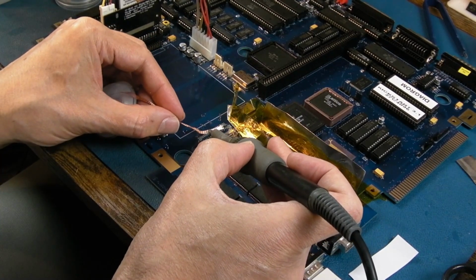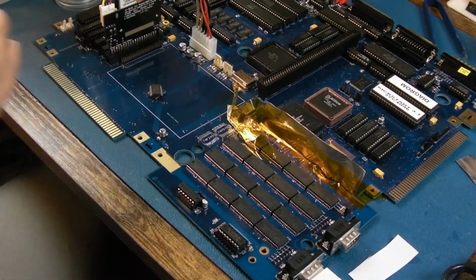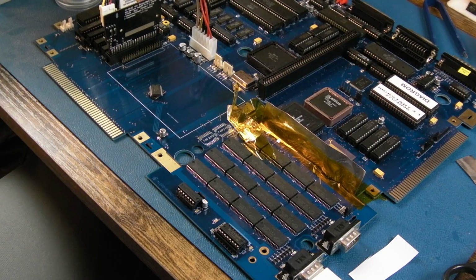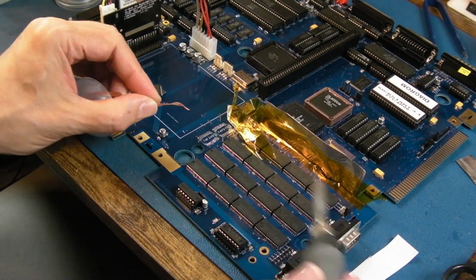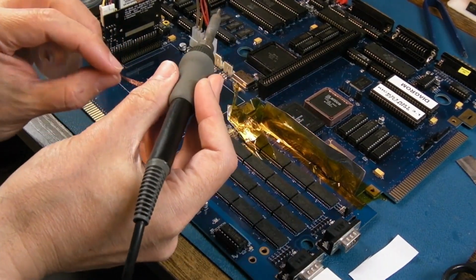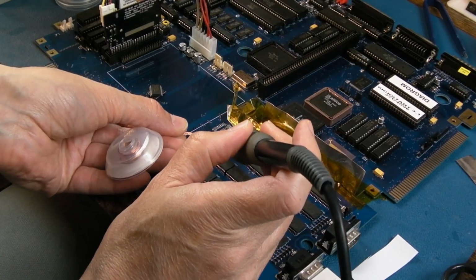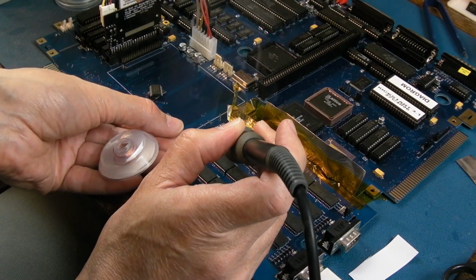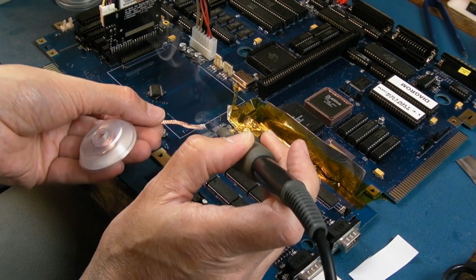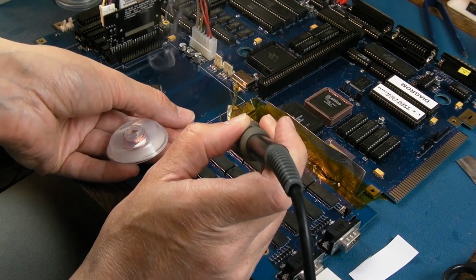I've scoped this and everything sort of looks alright, but there's kind of like what you see on the data bus where you get contention. And seemingly on both sides, so I'm like, maybe there is some contention here somewhere. Maybe the RAM's bad, maybe the 245s are bad, but the 245s is a lot easier than swapping out that RAM. And I only have 4 spare RAM chips, so if any more than 4 chips are bad, I'm knackered.